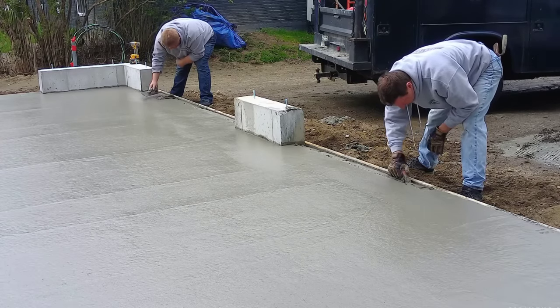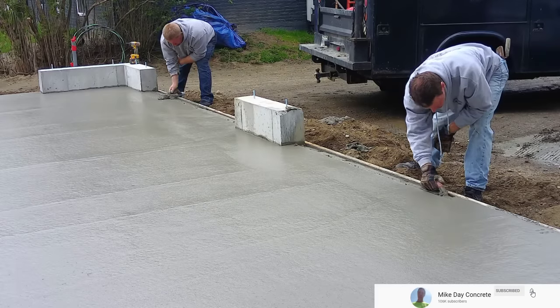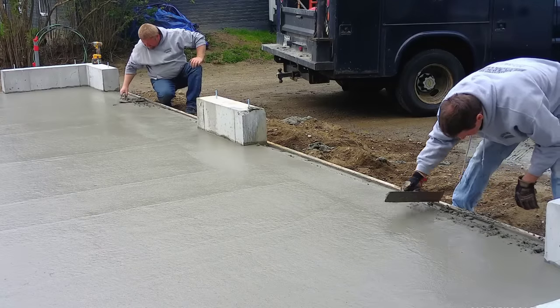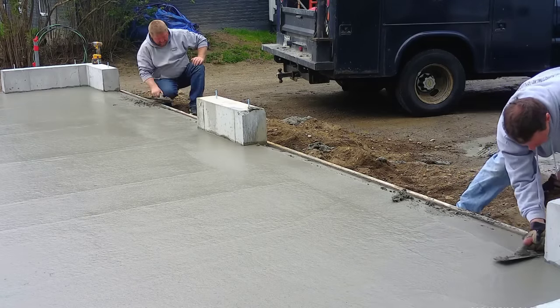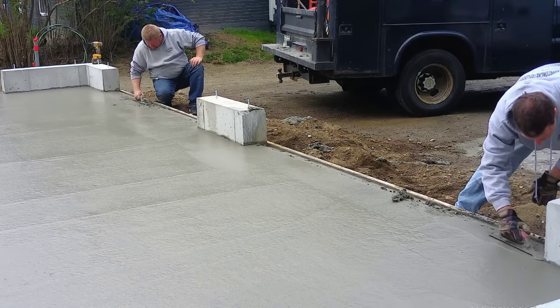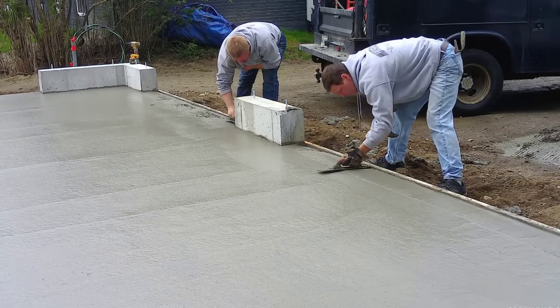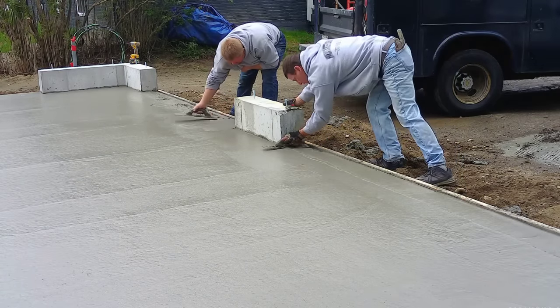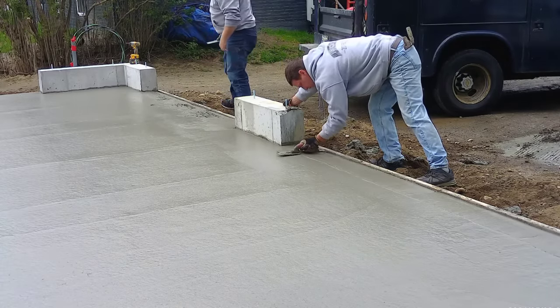Skill number one is cutting down a garage door. If you're finishing a garage, how do you taper those doorways? Basically, we dig out about a half inch of concrete along the form and then use our mag float to taper that edge down, giving it a nice tapered feel. When they drive into the garage, they're not hitting a square edge. Also, the garage door sets down on this, so any rain that runs down the door hits that taper and runs out.